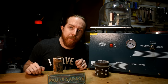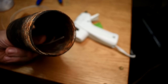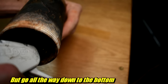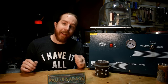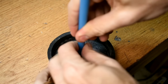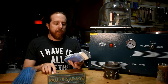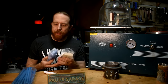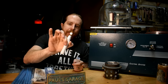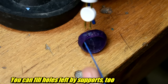It's not ideal, but I could steal it from the craft shelf in the kitchen — my wife's probably used to it by now. The only difference is I ran a couple of air channels up the inside to get the vacuum spread out more evenly, otherwise there's a lot of vacuum pressure at the bottom and not so much at the top. For the perforated flask I got the right stuff — a cap with a hole for the sprue, a 10mm wax sprue, a big pack of them, plus little wax straws in one millimeter and two-and-a-half millimeter sizes. I got a little wax pen for melting, and this reminded me a lot of TIG welding: little tip, button, the tip gets hot, filler rod — just like a TIG welder, only very tiny. And it smells like birthday cake candles.